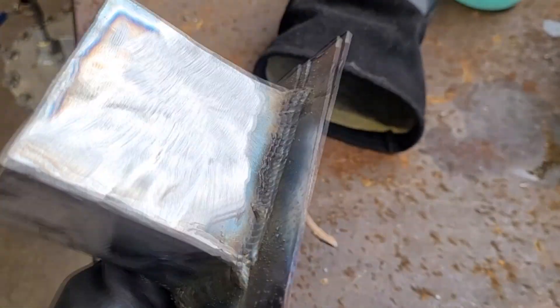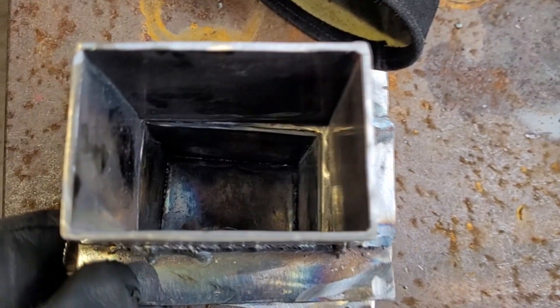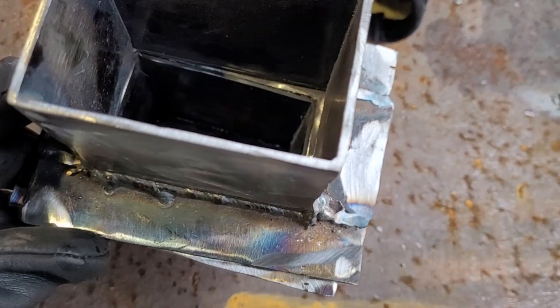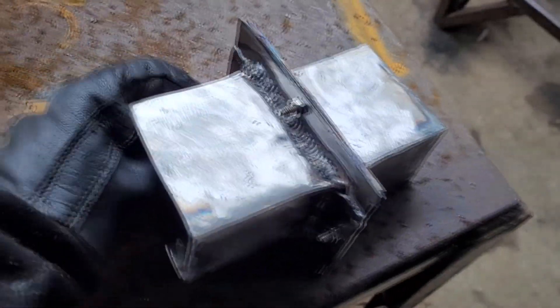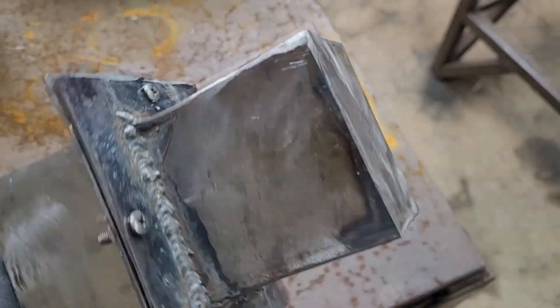This wasn't just one waveguide — I was designing two. One waveguide needs to be permanently welded to the reactor to keep it airtight, while a second removable one is where the magnetron itself sits. The flange between the two uses silicone and a mica sheet to make that connection airtight while still allowing microwaves to pass through. I got it all welded and it's done.